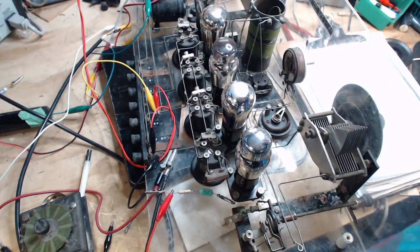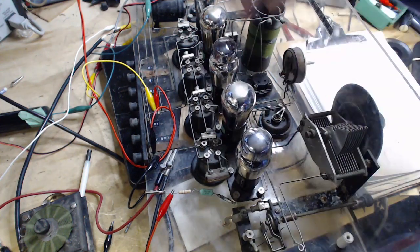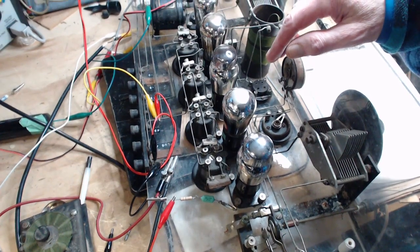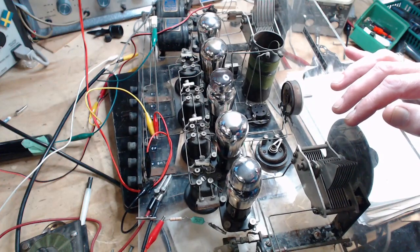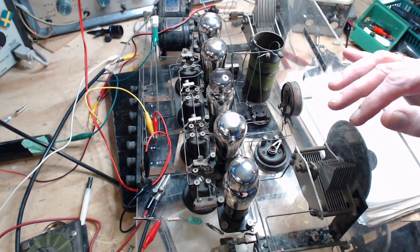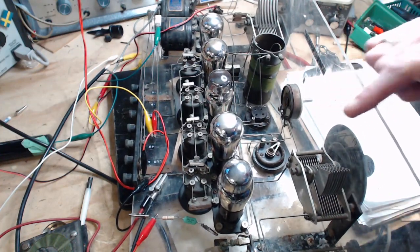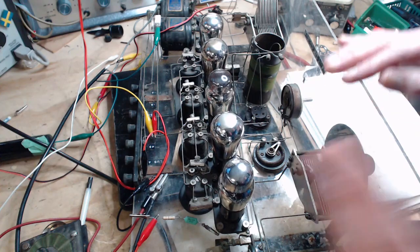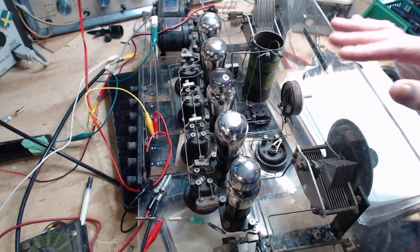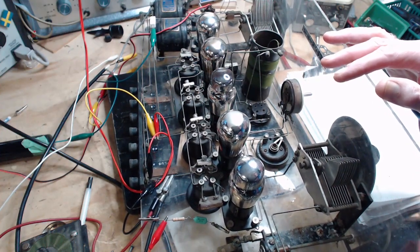And I think really what happened here is Mr. Lacault figured out the first truly efficient mixer circuit. Remember, these are triodes. And you're limited with what you can do with a triode. Later came better tubes, pentodes and things like that, which were used for mixing, and it became, problem solved. But in this radio, the problem is still here of trying to use triodes to generate a mixing. And then the whole thing about the Ultradyne is Mr. Lacault figured out a way to do it, and it's a really weird way. And I wish I could make this radio do it, but that's not where we're going here.